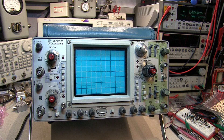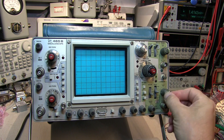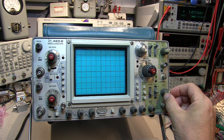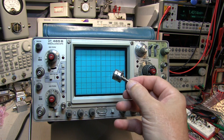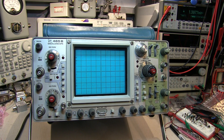On the bench today is my trusty 465B oscilloscope that I've had for over 20 years. The only thing that's really been wrong with the scope almost since I've owned it is the trigger slope switch for the A trigger. The A trigger doesn't make contact on the minus side, only on the plus side, so the switch itself is faulty. Thanks to a good friend of mine I've got a brand new replacement switch and pot for the A trigger control, so hopefully this will just be a short repair video.